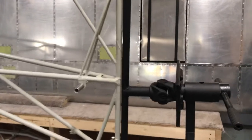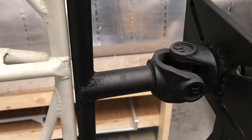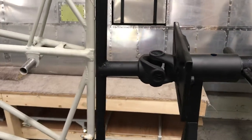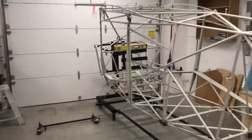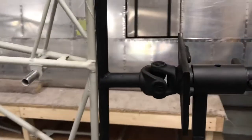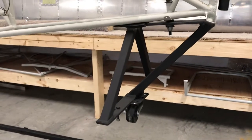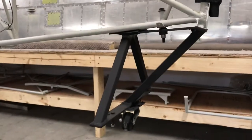What I've done is used the rudder mount — a piece of round black iron gas pipe — along with another engine stand and a universal joint off a drive shaft I got from the scrap yard. The u-joint lets me line things up without being perfect and allows for a little error correction as it rotates. It also lets me lower the front end down to the ground without binding and without having to undo the back end. That's why I need the long connecting pieces — otherwise this end would just be swiveling around with nothing holding it. The airframe is bolted on where the tail spring is going to go, and I can take it off the rear rotisserie and roll it around the shop on its wheel.